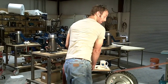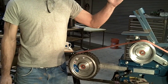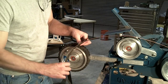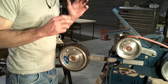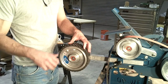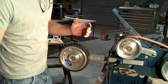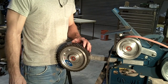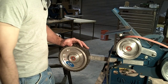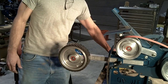I need to do a little talk on contact wheels because with surface grinding, to get a precise finish, a 60 durometer or a soft wheel is not going to get the results that you want. What I have here is a wheel just like mine that came with my grinder — the same blank except it's covered with a 90 durometer serrated. A 90 durometer serrated is definitely what I recommend for surface grinding in general and especially with this attachment.